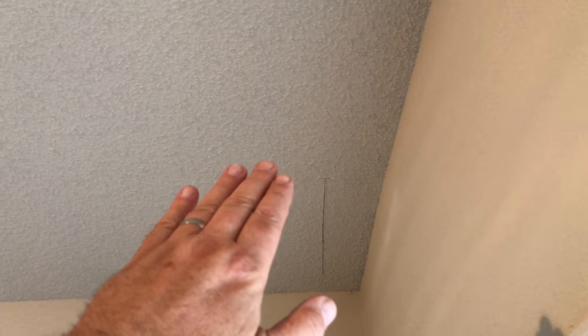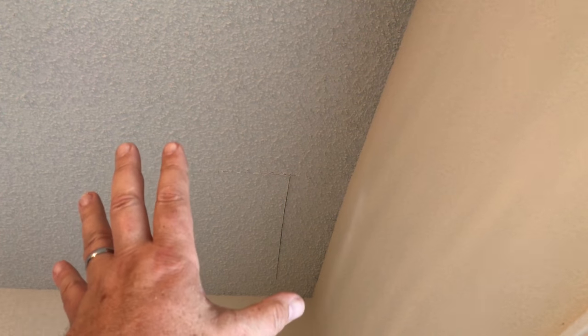As I'm making these cuts, I'm cutting at a slight angle. On this one, I'm cutting at a slight angle this way. This one, slight angle this way. Same other side, because a lot of times if you make a straight cut, you think you're straight and you're in the wrong way, and your piece you cut out, if you're trying not to destroy it, it's locked in because of the bevels you put on it by accident. So you gotta cut purposefully angled the right direction, so when you cut that piece, it just drops.